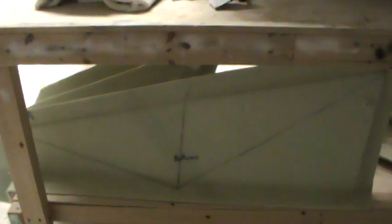Wing mold down there, you can see I've got some black lines drawn on it. That'll be where the rest of the mold support goes. I'm probably going to use 1/4 inch MDF for that, just because the stuff is fairly stable with temperature changes. And I'm going to have one piece across the leading edge, one there vertical at the trailing edge of tip, and another one in the center, and then these two diagonal pieces. That should be plenty. I mean, the mold is fairly stiff as it is. It's almost 1/4 inch thick, so it should be fine. I'm going to do that on both sides.